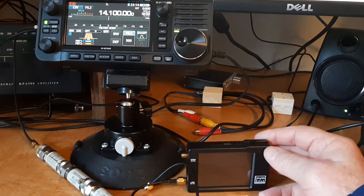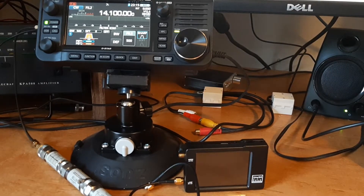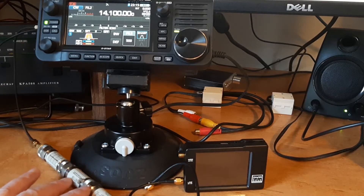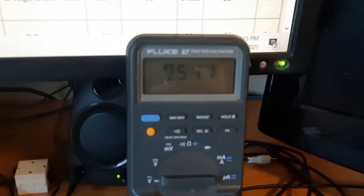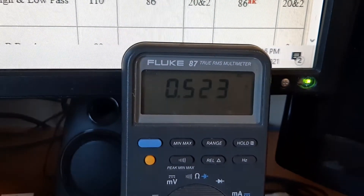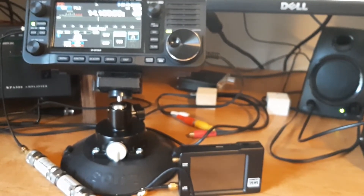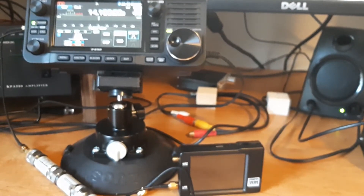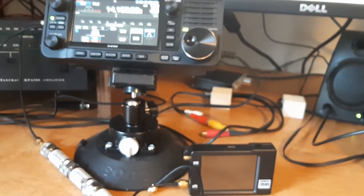I think these go for around $50 — I'm not really sure what they're up to now, I bought this one right after they first came out. But with a TinySA and some external attenuators and an RMS multimeter — it does have to be RMS, it'll probably say so on the case — you can make an MDS measurement that's quite accurate, surprisingly accurate, of a receiver in the HF frequencies for the ham bands or a shortwave receiver.